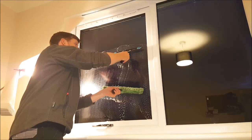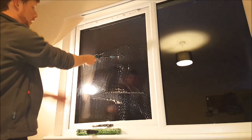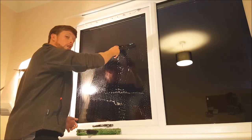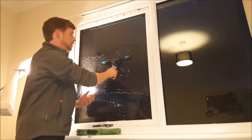So pull across the top. In 25 degrees, my hand is maybe roughly about two to three inches away from the glass. Now if you're in 10 degrees — you push this button on the side into 10 degrees — you need to have the handle further away from the glass, more almost out at zero degrees. If the window was straight in front of you on the end of a pole, you would need it in 10 degrees. Now if you were quite close to the window and the glass was above your head and you're trying to close out to the bottom, put it in 40 degrees, which means the handle has to be closer to the glass. So: 40 degrees — very close to the glass; 25 degrees — medium distance away; 10 degrees — maximum distance the handle has to be from the glass.